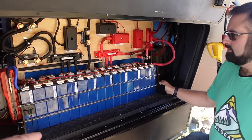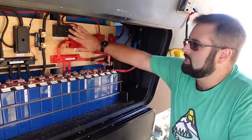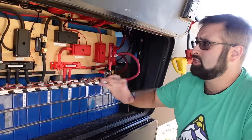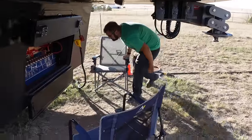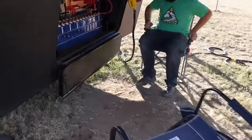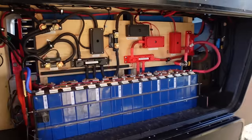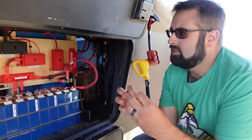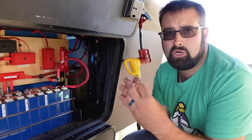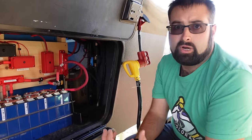The batteries are the blue stuff; all of these are bus bars, bus bars and shunts and cables. We got some chairs because we're both breaking our backs crouching down under here. Shunts — what they do is they allow you to measure the amount of current going through them. Their primary goal is for monitoring. A very prevalent issue is people look at the little control panel in their RV that says your battery is at four dots — that's based on voltage.